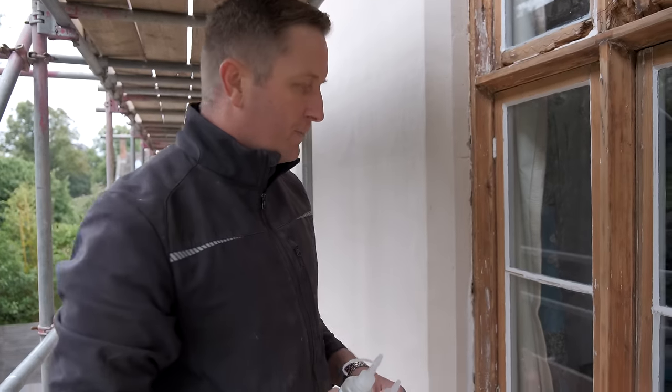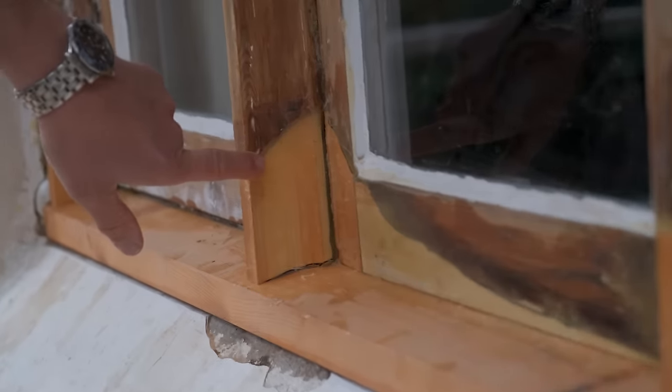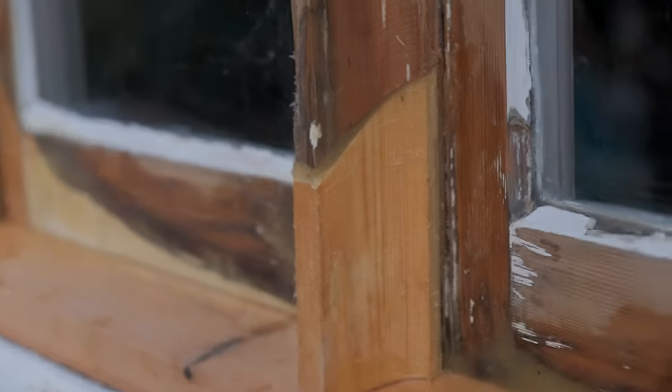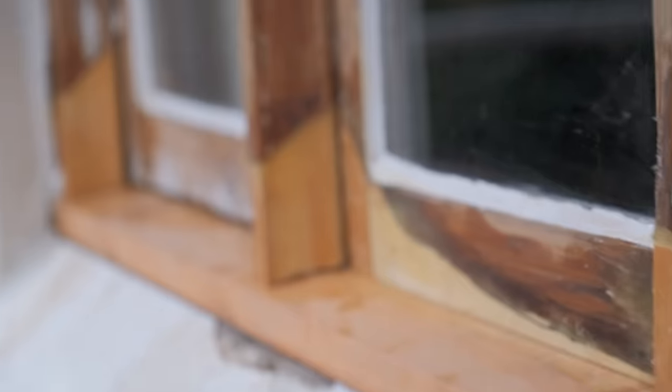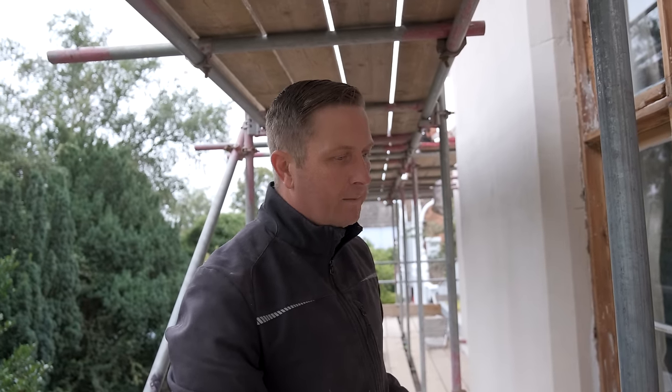This should be as good as new when I've finished it. On these pieces down here, I fully understand there are gaps where I've spliced in — that's done intentionally, because if you have too tight a gap it doesn't allow for flex in the resin, so it's actually doing a worse job even though you think you're doing a good job. When all this is sanded up it will look like it's never been done when it's painted.